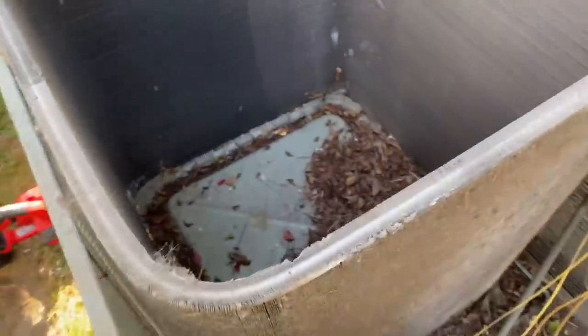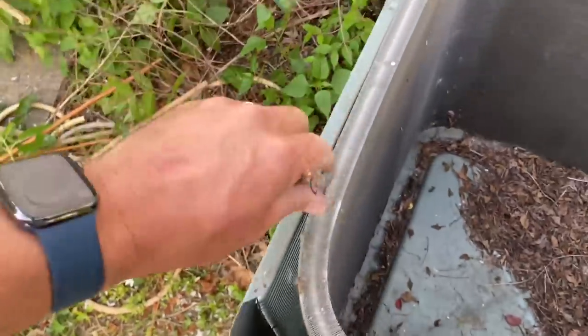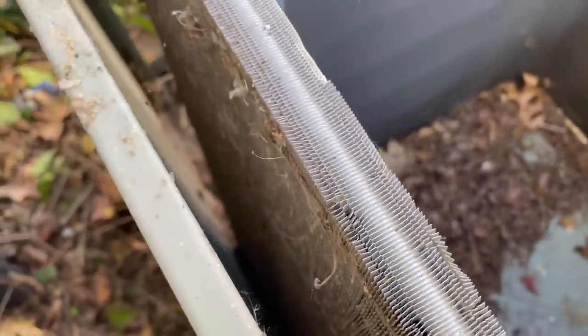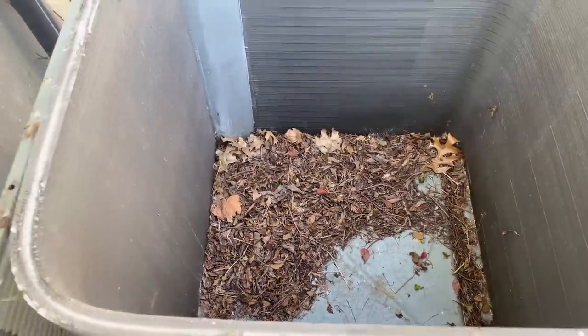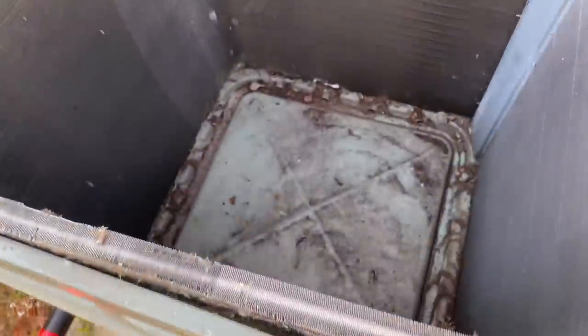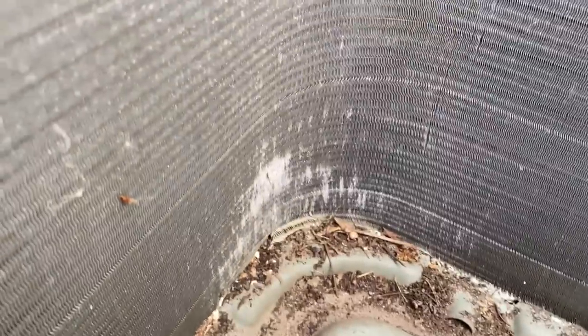Let's take a closer look at what's going on inside — remove any extra vegetation that's growing inside, like that. Take a look at the coil. She looks pretty good actually, not terrible surprisingly. We're going to clean all the vegetation from the bottom of the condenser. Our inside looks much better. Other than that corner right there, I don't see any visible damage. Let's take a look at the condition of the outside as well.